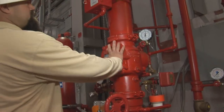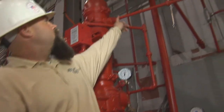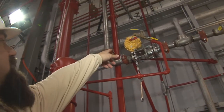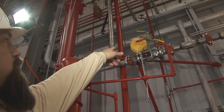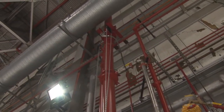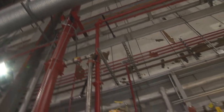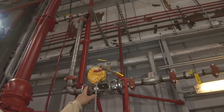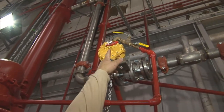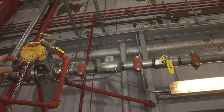This deluge valve, once activated, you get a surge of water that rushes through this half-inch pipe and hits the HOV valve, opening it up, which allows the foam to go up and mix. Right now they're still working on the tank, which is in an open position. Normally you can indicate whether it's open or closed by this red dial — it flows with the pipe, so it is open right now.